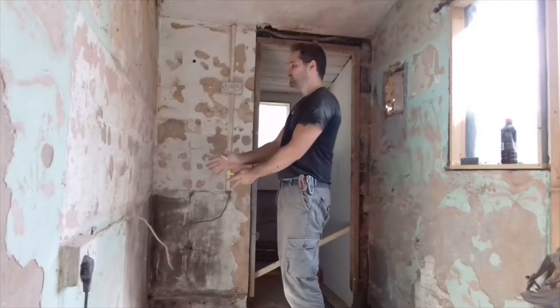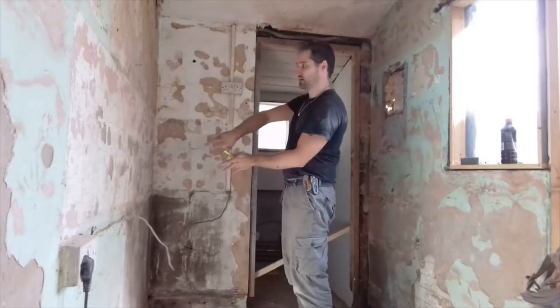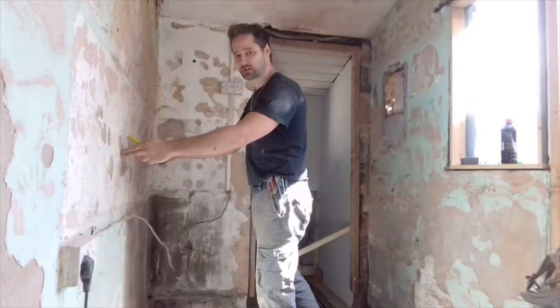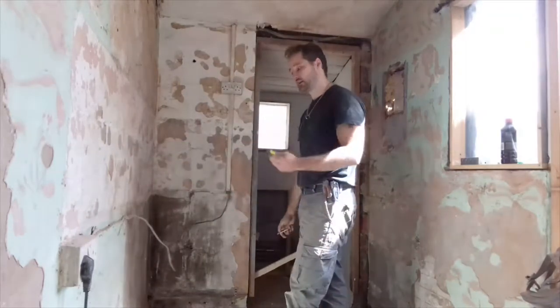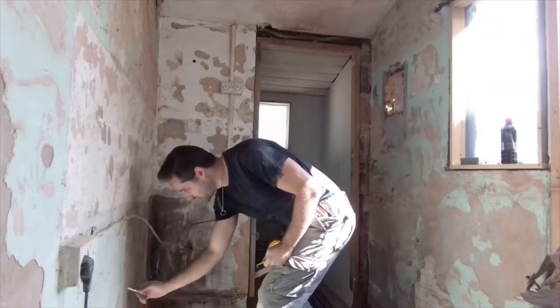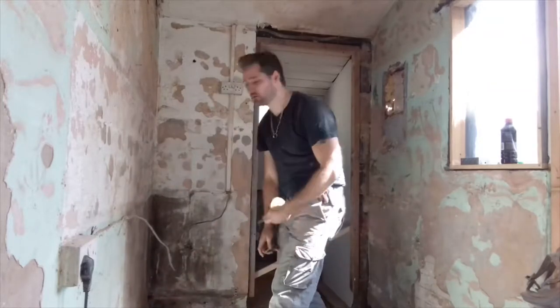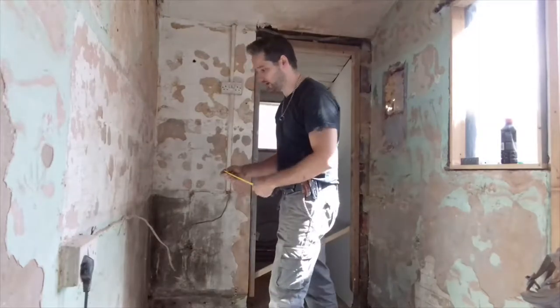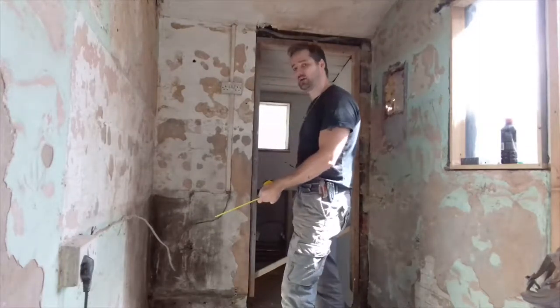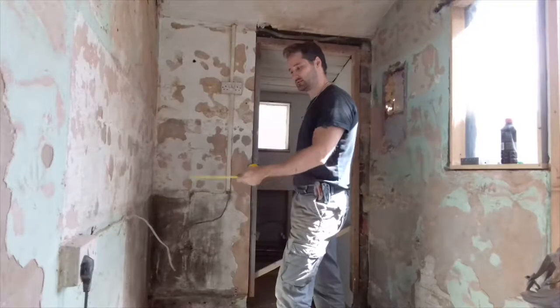There'll be a plate face, as it were, here. You now know that you've got your 600 gap here with a little bit of 600 worktop with your white good going underneath. Now you know, right, I need a power point for the washing machine, dishwasher, whatever you want to put there. Doesn't really matter so much where that one is, as long as it's out of the way.